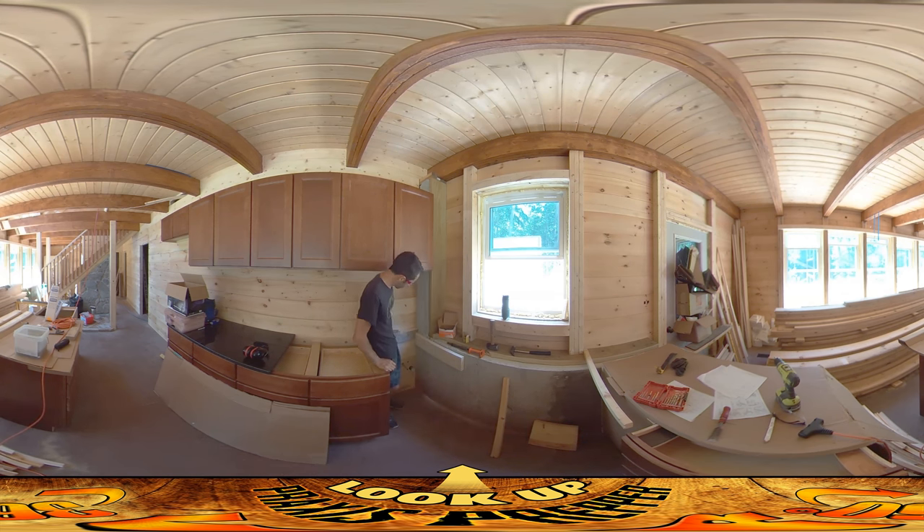At the moment I'm working on this surface here and I need to affix it to the concrete — and I always love to show that on camera because it's fun to show explosions and things like that. I've got a couple holes pre-drilled right in here. I do that because it reduces the chance of the wood splitting, but it also helps the energy from the charge go into the concrete instead of having to work its way through the wood. It's probably minimal, but it's something.